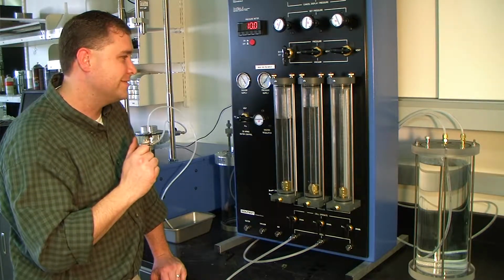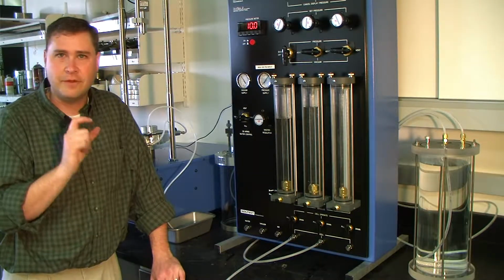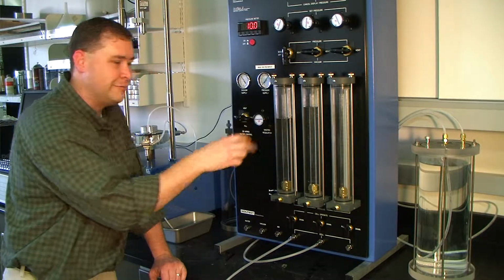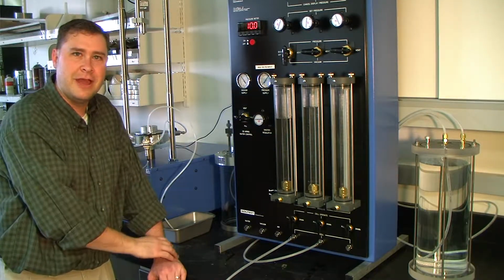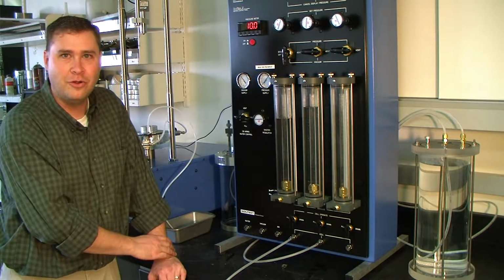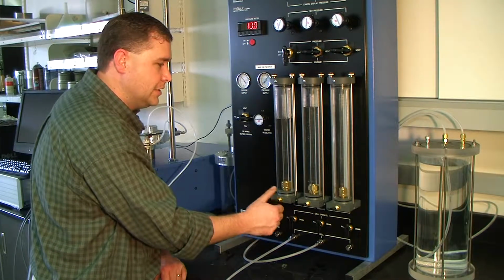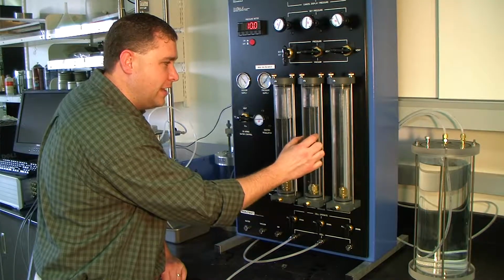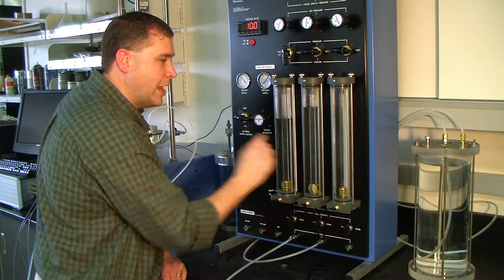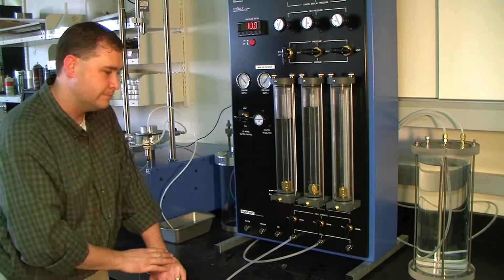Okay. Also, if you reuse membranes of your triaxial sample, you can see if you have holes, because when you supply pressure, you can monitor the amount of water coming in or out of the sample, and you'll know if water's going in when it shouldn't be. You may have a hole or a leak in your system inside your cell. Okay. So this just opens or closes the outside water from the inside of that glass tube. And the inside is how you read accurately the amount of water going in and out. Okay? And I'll demonstrate that later.